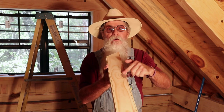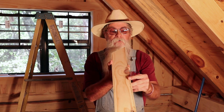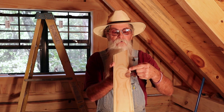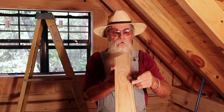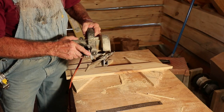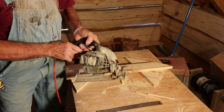If you can see these pencil lines down the edges, that's where I'll saw. I'll be sawing pretty crickety. Then I'll come back with a grinder and shape this. You can see a knot here — I brought my line out to the edge of the batten strip, then came back in. My buddy that showed me this said it'll leave the knots a little more bold and they stand out a little better. I've got my saw set on 30 degrees and that seems to work pretty well for what I'm doing. I'll cut this out and then I'll grind it.